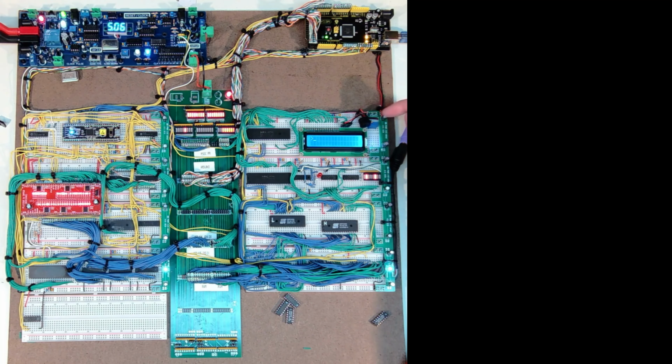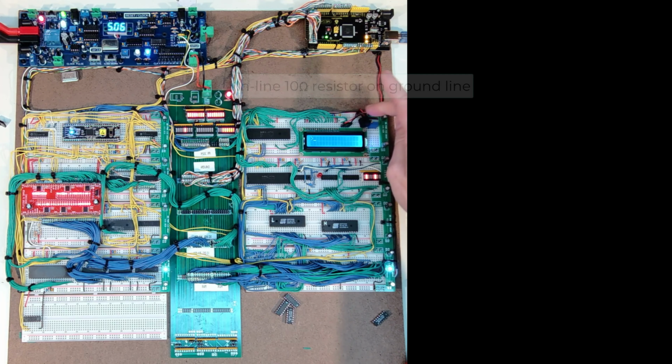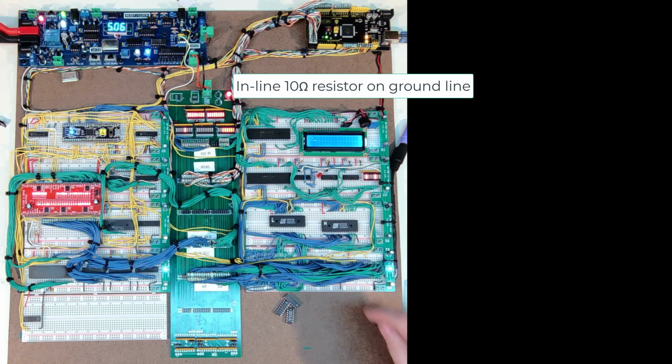So to support this is just a basic PC speaker, kind of a power on post type speaker. I've connected that to one line to ground and the other line to one of my pins on my PPI number 1.